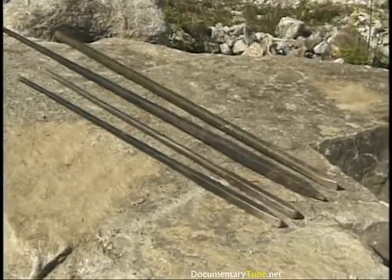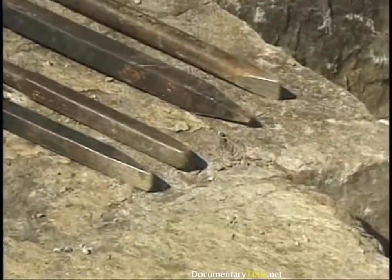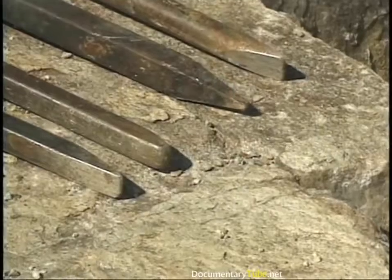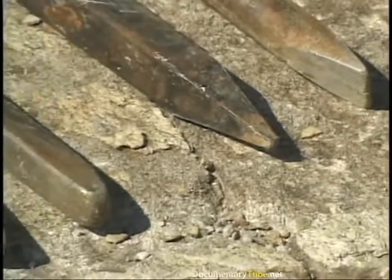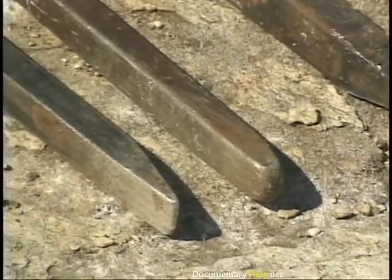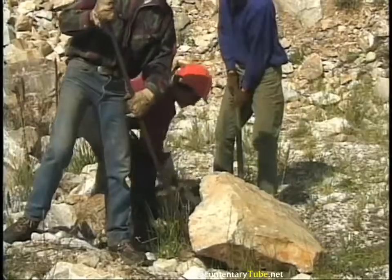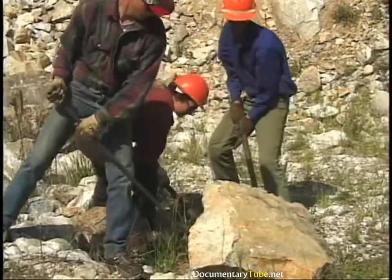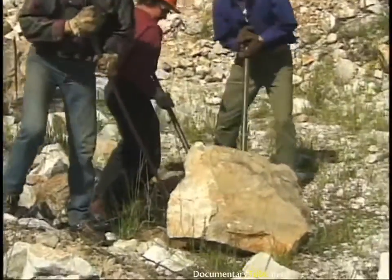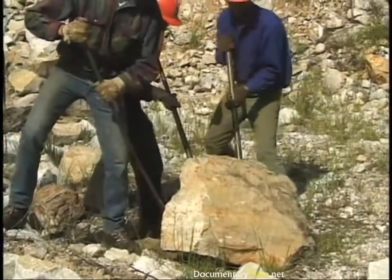The bottom end of a good rock bar is square with a chisel tip, and that chisel tip is a 2-inch fulcrum, basically, that you can use to lift with, and then the upper end of it is usually round. It's best with big rocks to have a team of people. Once you start using rock bars to move a rock, you don't want anybody in there with their hands on the rock, because a rock bar can slide across that rock and mash fingers.